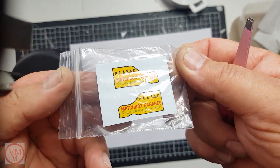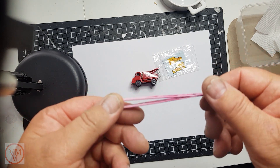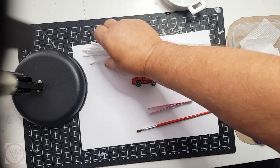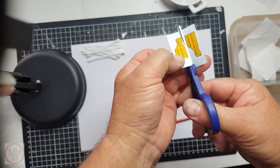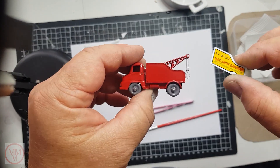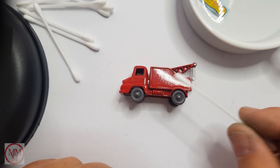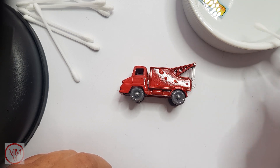Now I've got some reproduction decals to put on. I've found some pink eyebrow tweezers in the en suite — they'll do. You need a paint brush, some paper towel for removing moisture, and some cotton buds or Q-tips. I'm cutting the decals out with scissors roughly to size, just to give them a test fit to see if they're correct — you can never assume. They're looking quite good, so I'm dunking them in lukewarm water and moistening the vehicle whilst they separate from the backing sheet.